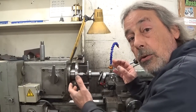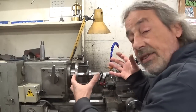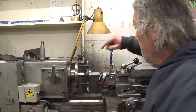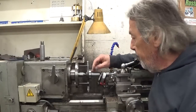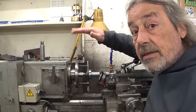Completely ready to go. But when I move the carriage left and right, the whole bed is twisting and it leaves a bit of a wavy finish on the part. Now I tried to film it, the camera doesn't pick it up, but when I rub with my finger I feel that really there is up and down.